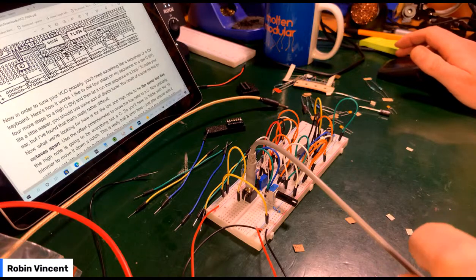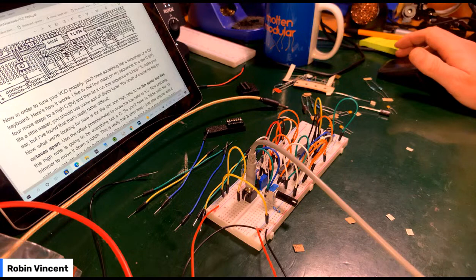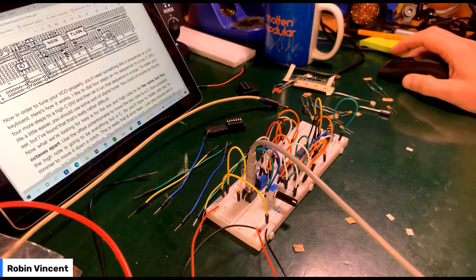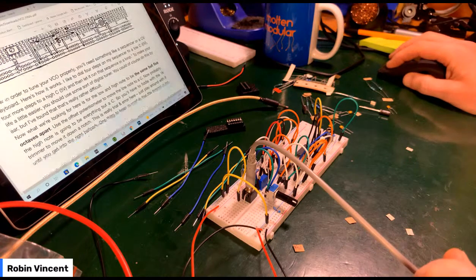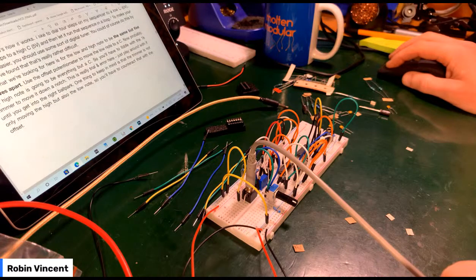Use the offset parameter potentiometer to move the low note to C. Then you have to fiddle with the 1K trimmer to do the top note. The trimmer is not only moving the high, but also the low, so you have to keep counteracting that with the offset.